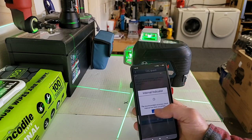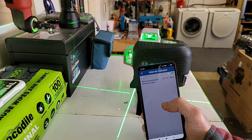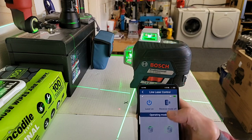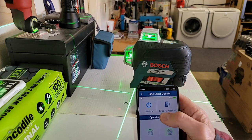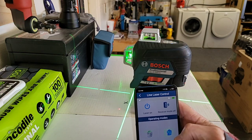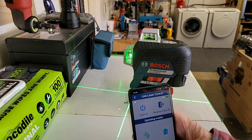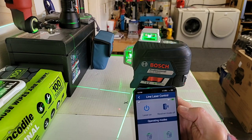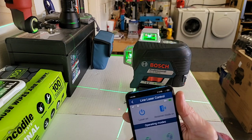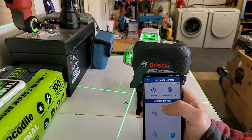The interval check is what it does every year — it'll tell you when to do it again. It's telling me to do it again January 30th of 2022. Really cool that you can do the calibration. You can also do the laser line control — lasers on, receiver mode on. We can turn the lasers off and do just the horizontal, horizontal vertical, all three, or just the vertical — mix and match however you like. And if you do have the green line receiver, you can put it in receiver mode and use the receiver to figure out where the line is if you can't see it really well.